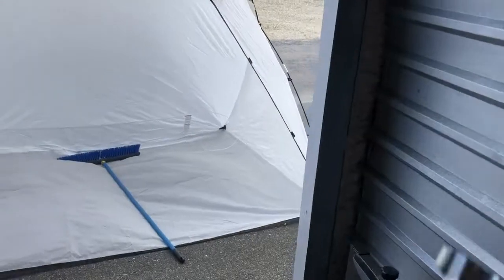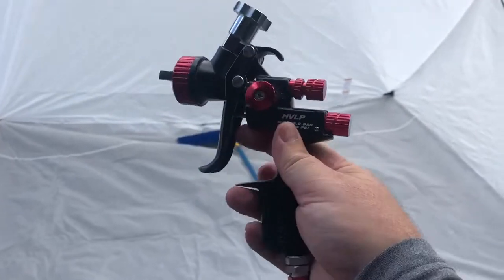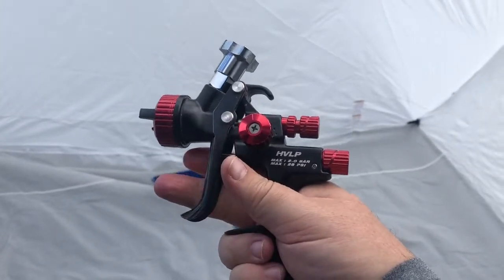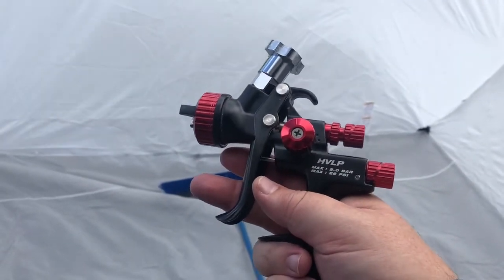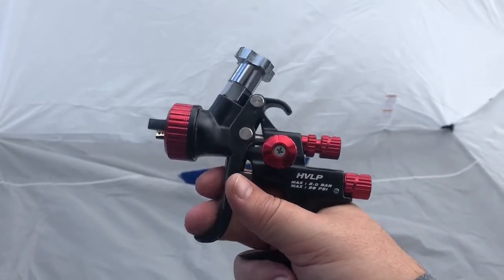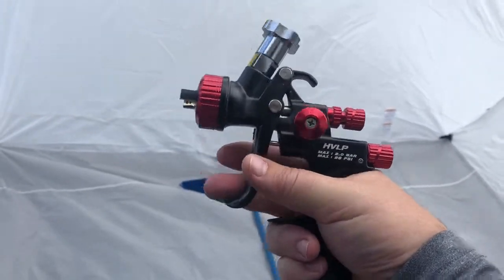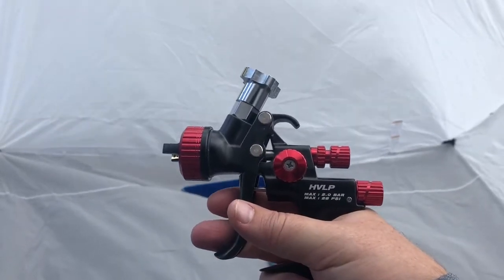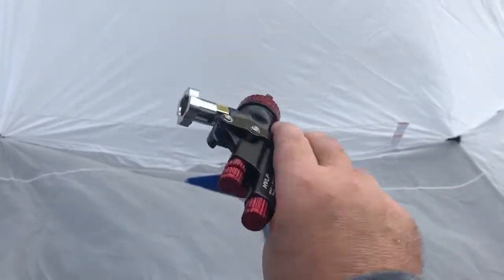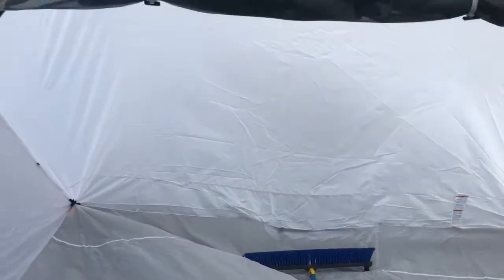Had a minor setback — no big deal. I tested out this Harbor Freight Spider spray gun, which is a little bigger and highly rated. I'm going to use this instead of my Surefire — my professional, expensive one apparently gave up the ghost and is being shipped back for repair. I know this Spider works because I used it to spray the hood for our kitchen remodel and it worked out great. It's gravity fed, so I need to be mindful of that instead of vacuum fed.